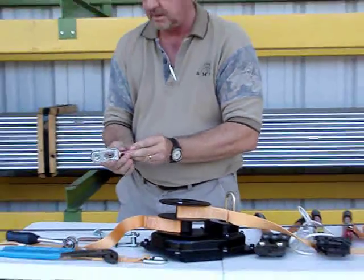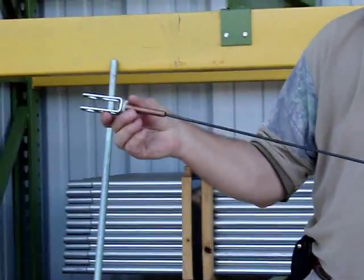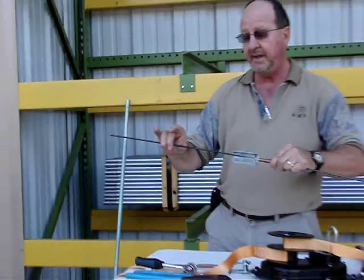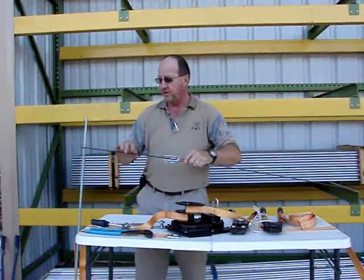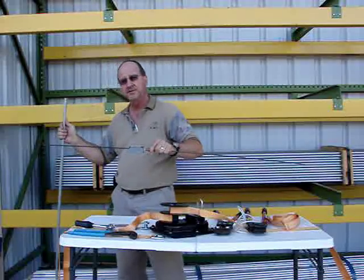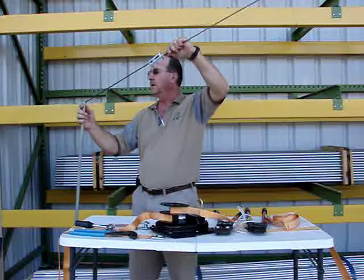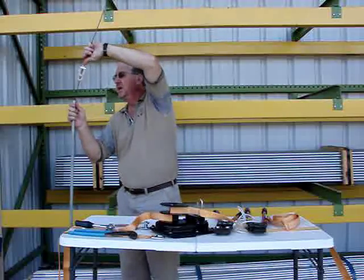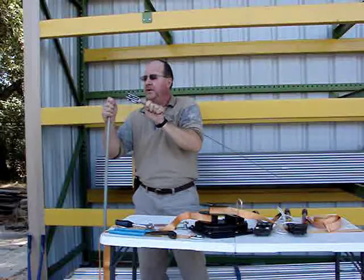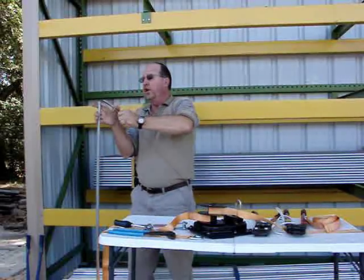This gives us a chance to take the carbon rod — the end of the carbon rod — and slide it up into the copper sleeve. We want to slide it up and get enough room so we can bend it. Now this rod is hard to bend, so we're going to use plenty of length to make it easy for installers to bend the rod. I'm going to use a simple half-inch piece of conduit and put the rod into the conduit about a foot. Make sure you're safe with this, because when you bend this rod you don't want it to come out and hurt anyone. We're going to bend it a little bit over 90 degrees.